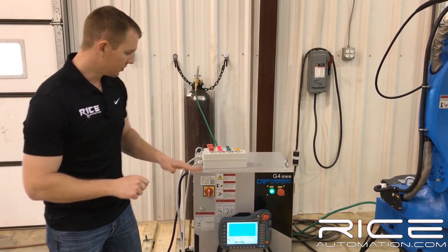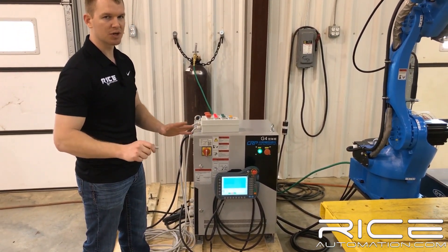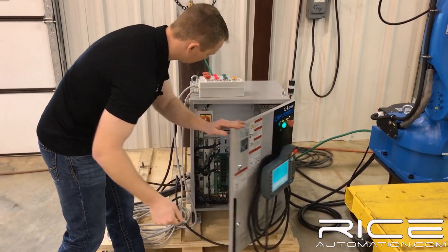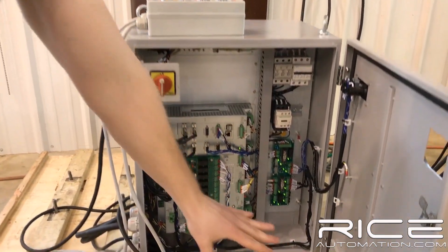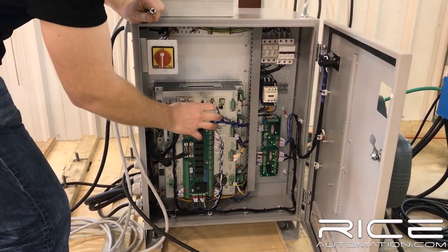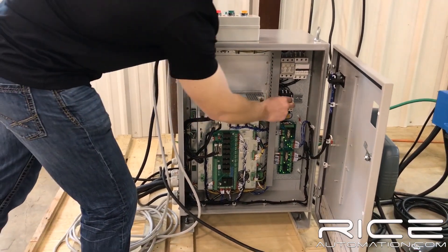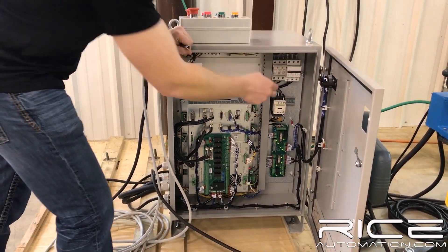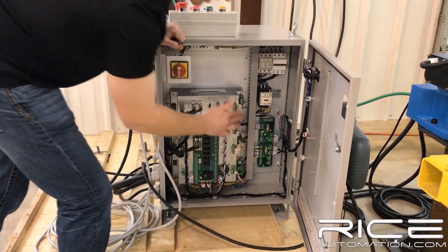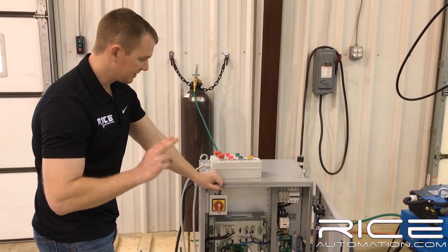Now I'm around to the front of the cabinet. You'll notice the size of this cabinet is the first thing that hits you — it's a small, compact design. Inside, we've got our air intake, our main servo board, and all of our connections. This is an I/O board, so you've got your outputs and inputs. The main contactor is here — any time that head goes out, it cuts all power to everything, along with a safety board with dual-channel safety inputs, so you've got double redundancy on your safety.